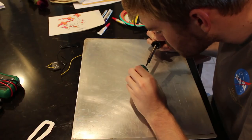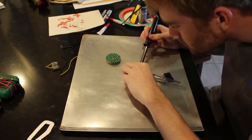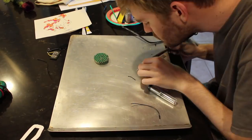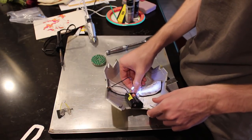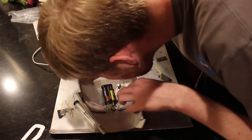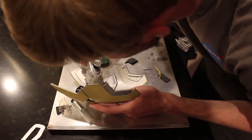For the electronics, I desoldered two LEDs from an old flashlight. I connected these two in parallel with a 2AA battery box and a small switch. Once those things were all soldered together and tested, I hot glued them into place. I made it so the two LEDs for the eyes are in the middle shining outward, so the eyes are evenly diffused. Once everything is done, here's how it looks.